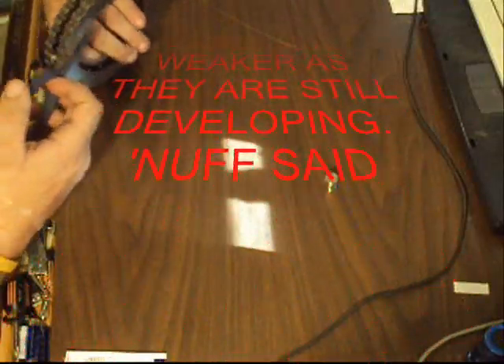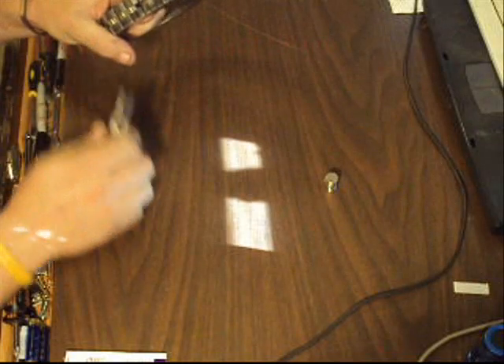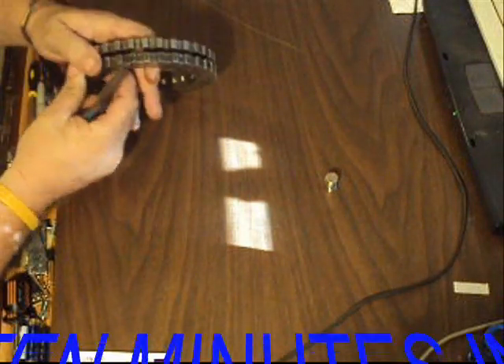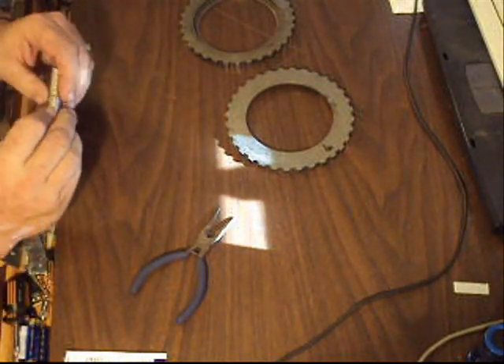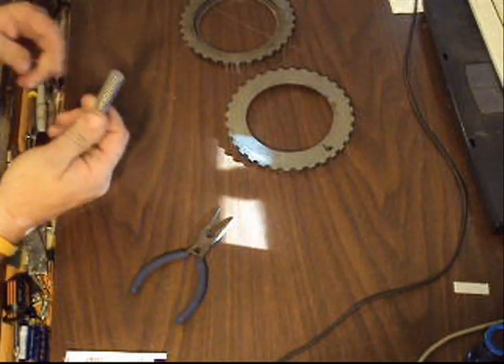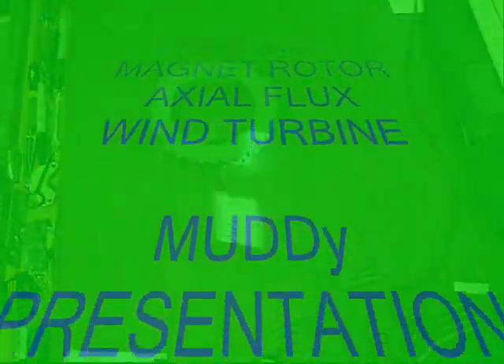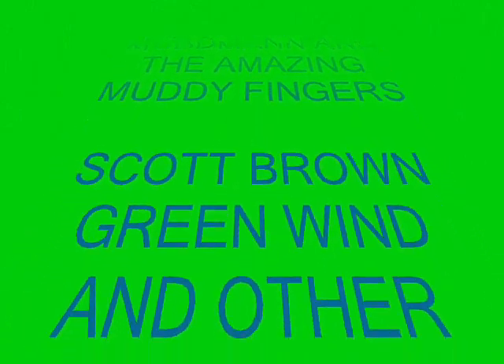None of the magnetic force is leaving the ring. A decent-sized metal backing for the magnetic flux to flow through — make sure that all the magnets are in the middle. I think we're close enough where I can get these apart. Oh yeah, that's a lot better, and it's a lot easier. Don't leave a razor knife on the desk near these. I'm Scott Brown with Green Wind and other Home Energies — we'll get into winding some coil sets. We'll be right back. Thank you.